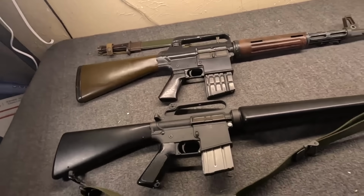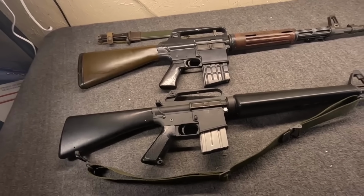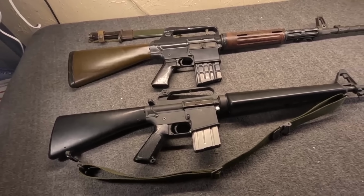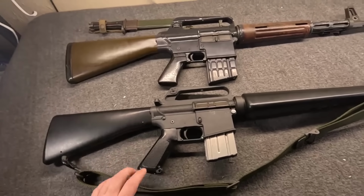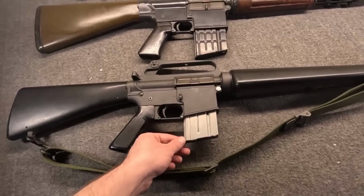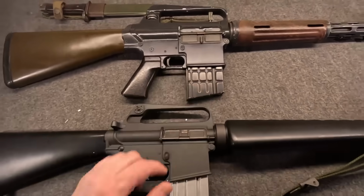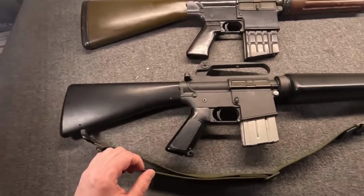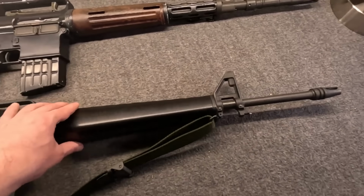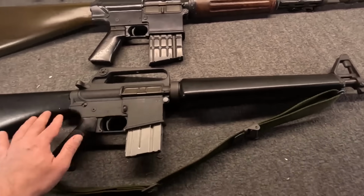Thus, in December, Colt had the first batch of 300 so-called Model 01, later 601, we'd call them, guns released. And we're getting closer to what we have here. One change Colt made: the Armalite gun had a 25-round mag. Colt would go to a 20-rounder with the waffly pattern like up here. Also, they would go to the three-prong hider that had been experimented with. The handguards. Now, the gas block on the early guns was cast. That's actually kind of important.